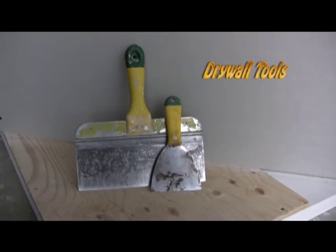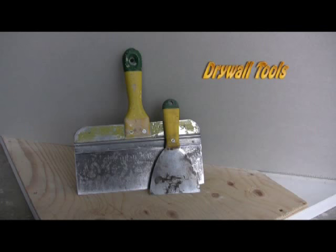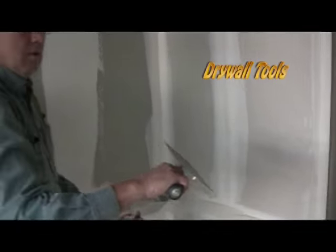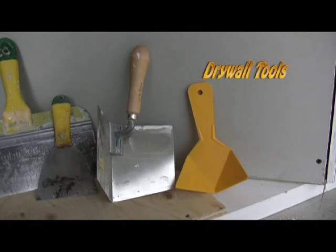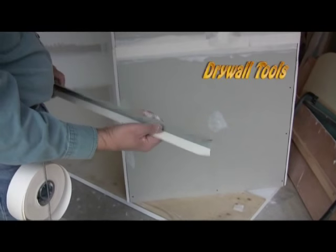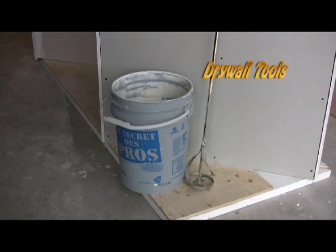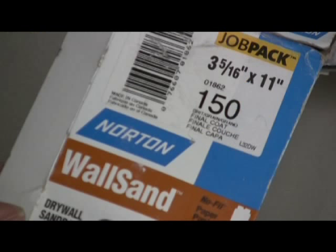Drywall tools for the beginner. You will need the following tools to tape and finish drywall: mud pan, 4-inch steel knife, 5-inch steel knife, 10-inch steel knife — this is probably your most important knife for finishing the job properly — 10-inch to 12-inch concave trowel, corner tool (if using this, be very careful not to put too much mud in the corner; I prefer to use the knives), paper tape, paper-covered corner bead (if not available, use metal corner bead), bucket of water and mud mixer for wetting down mud and cleaning tools, pre-mixed multi-purpose mud, hand or pole sander and sponge block, 150 to 220 grit — to be used carefully and sparingly.